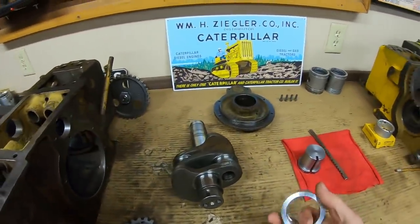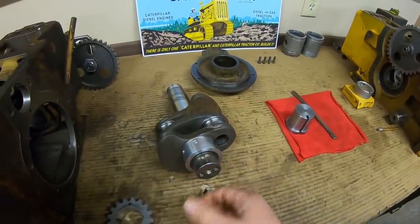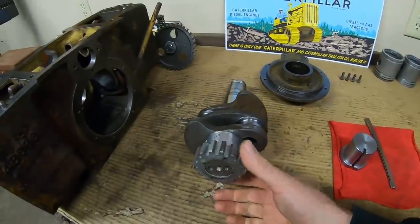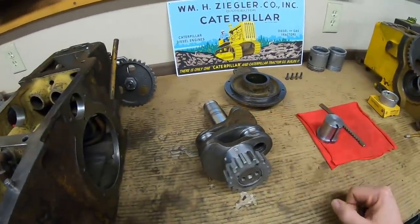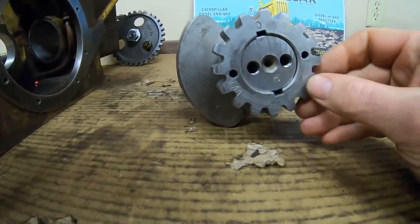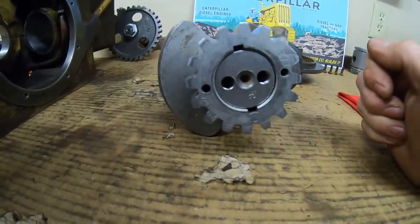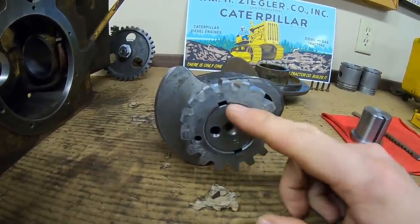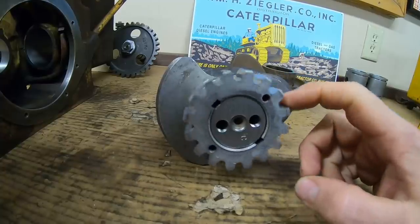Crankshaft end-play is all contained in how deep you make the bearings. I was able to employ my crankshaft end-play tool again - I took a little bit out of the inside of it, bolt it on there, and we can decide how thick to make the bearing. I've got a nice 10 thousandths end-play, right down toward the tighter end of spec. Someone in the comments asked about those alignment marks - those two C's are in line with the key slots, and yes, you can get them out of alignment if you're not careful.